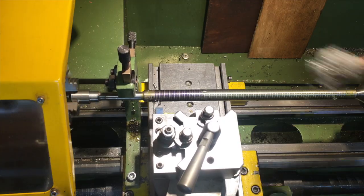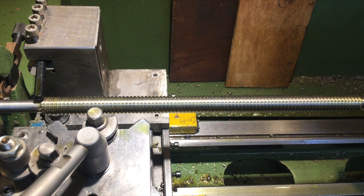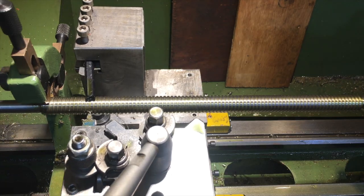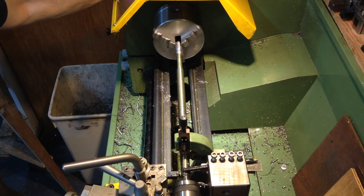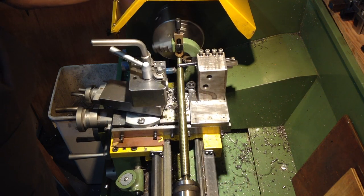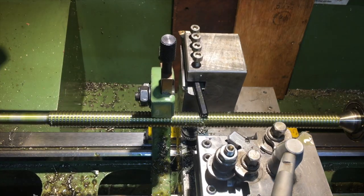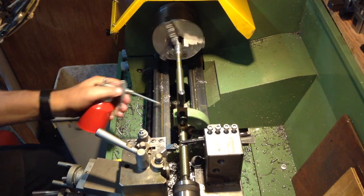Totally aware of the risk it poses regarding rigidity. Despite having the following steady fitted I still had a big problem with the first 50 millimetres of cut, all down to the following steady not being engaged at the same time as the tool. To combat this I fitted a back post and clamped a narrow steel bar in it to hover 0.025 millimetres above the screw thread, acting a bit like an extra steady right above the cutting tool. It didn't stop the vibration noise during the first 50 millimetres but it did help prevent the screw grabbing the tool and climbing all over it until the follower steady fully engaged — and it worked so well I decided to use it with the finishing tool as well.